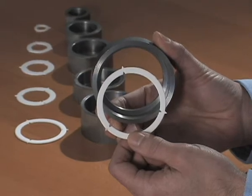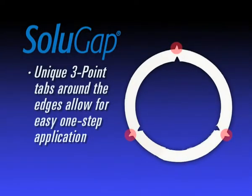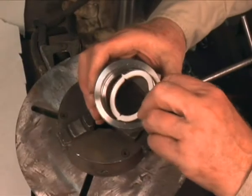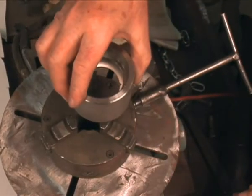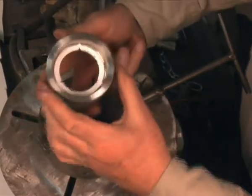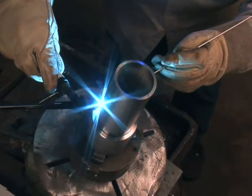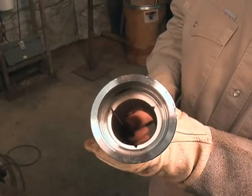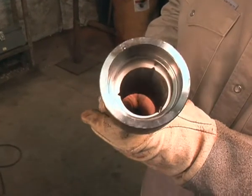Solugap rings possess unique three-point tabs around the edges that allow easy one-step application — just snap in and weld. The rings stay firmly secured in the socket, no matter the pipe orientation. Because the spacer is a hollow ring, viewing is not compromised during socket welding.